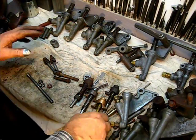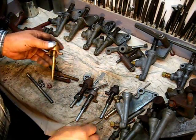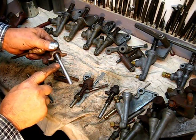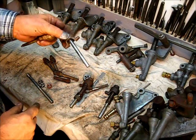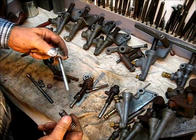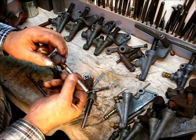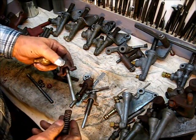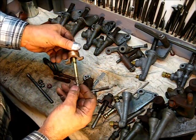The amount of wear that these engines will tolerate and still run is unbelievable. This one has wear right here where the packing is — to the point where you can feel it. This would not be a reusable plunger; it would have no longevity before it started leaking. This one right here is pretty good — I can feel a little wear; I wouldn't use it. But this one you could probably get by with for a while. It's supposed to be perfectly straight, but you can see how much this one's worn — even tapered down on the end.